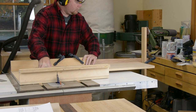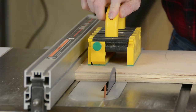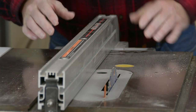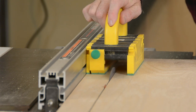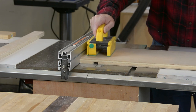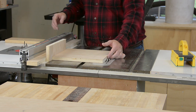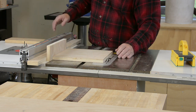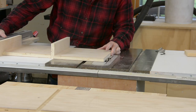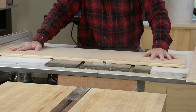The shelves all need to be exactly the same length as well, but the crosscut sled isn't big enough to put the stop block on directly, so I had to jury-rig an extension. There are two small decorative pieces called battlements cut using the table saw fence. Then you can cut the skirt that goes across the bottom front of the case. Once that skirt is cut, you can use it to set the fence after the dado blade is installed. The first shelf needs to go exactly the width of that skirt above the bottom of the case. The second shelf is the skirt plus the first shelf plus another divider, so you can gang those three pieces together, stack them right up against the dado blade edge, and you'll be sure the second dado gets cut exactly where it's supposed to be. You can lather, rinse, repeat this system for the third dado, although it does start to get unwieldy with all those pieces.